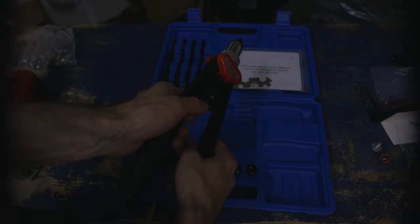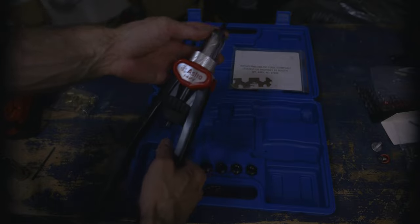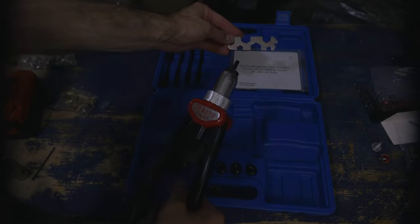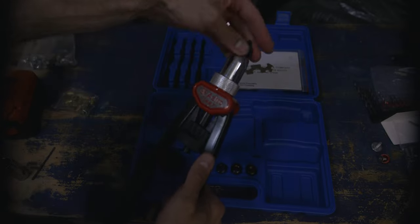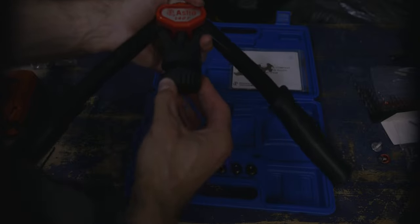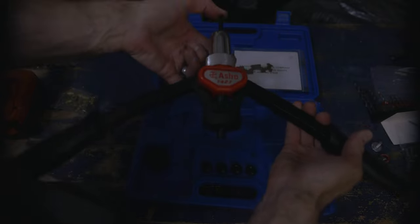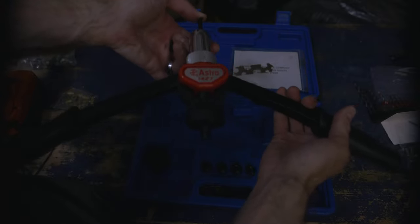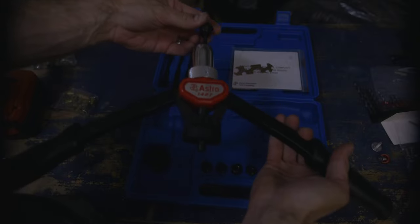Here is the rivnut tool I've linked for you guys. It's going to come with the wrong size installed — it's going to have an M8 installed; you need an M6. You're going to use the wrench kit that it comes with — it's like a little key with multiple sizes. You're going to loosen the top nut which retains it, then remove the bottom piece. Once you do this, you can press down, twist it counterclockwise, and install the proper M6 one. Then use the appropriate retainer nut on top and lock it in place.